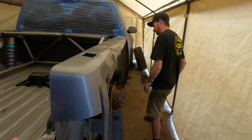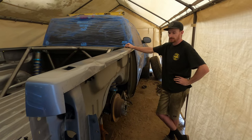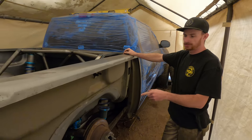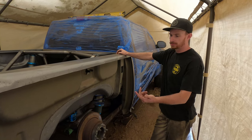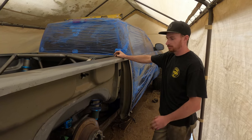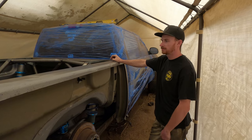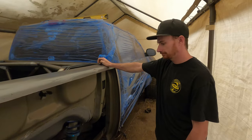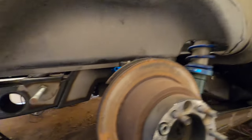When this truck came here, it didn't even have a bed on it — it was literally just two bare frame rails. The only thing on it was the fuel cell cradle from Izzy Fab that Aaron had mounted underneath. Other than that, it was bare rails. I started cutting all the bracing that was between the frame rails out and then plating the frame in, starting on all that stuff. So let's go over the frame because that was the foundation to build everything you see now.